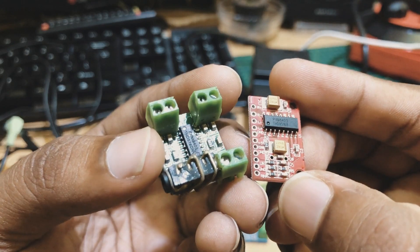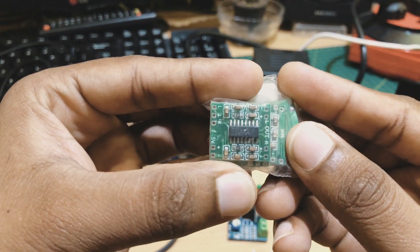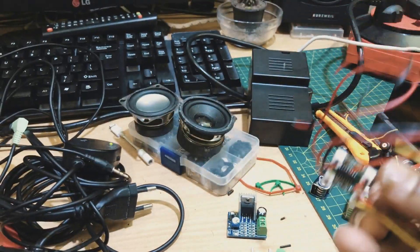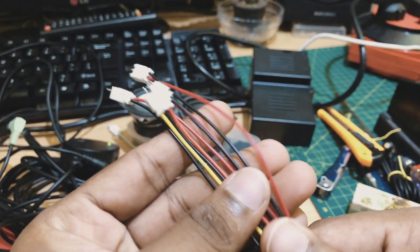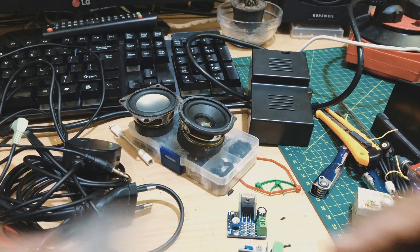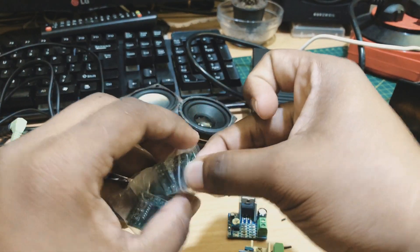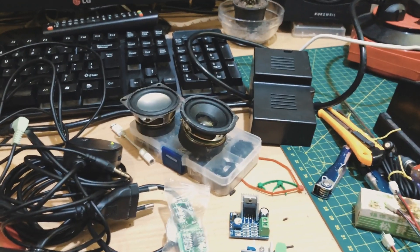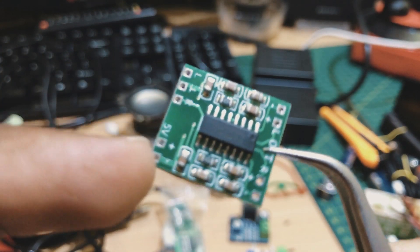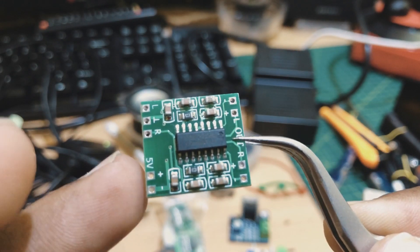The chipboard is the same but it is a little different. This is the wire. This is the audio signal input, this is the power and speaker voice. It is really cheap and good sound quality. It is 5V power input, audio signal input left and right ground, and speaker output left and right.